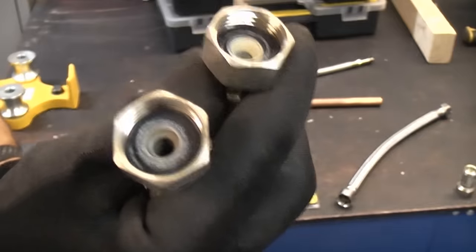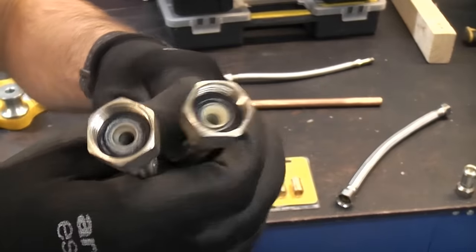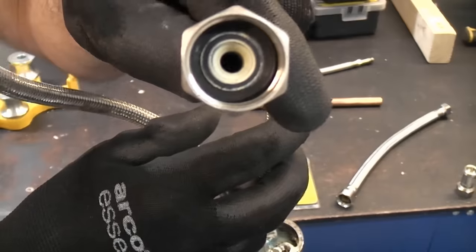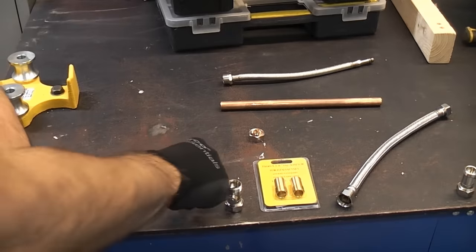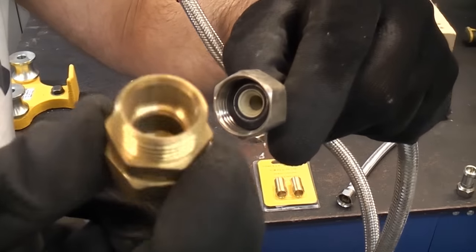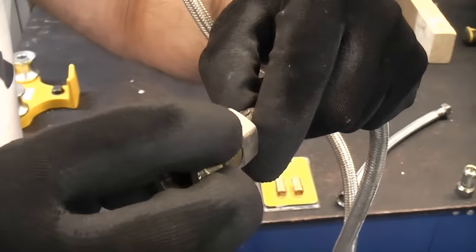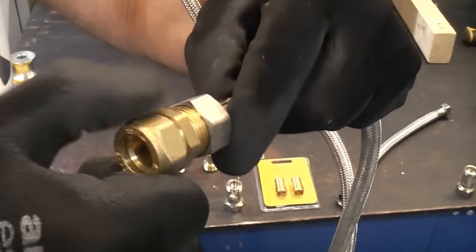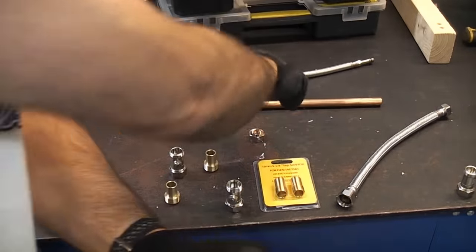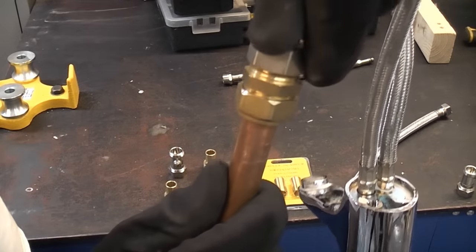Female ones are more common, and again they are half inch BSP — you can also get 3/8 BSP. If you look there, there is a sealing washer. Years ago I was actually told that you could screw these directly onto a compression fitting, so that would screw in there and tighten against the rubber washer, and then obviously your pipe goes into that end of the compression fitting.